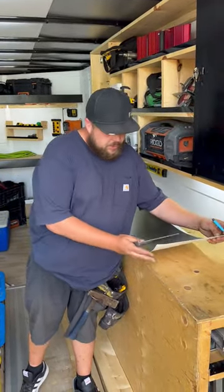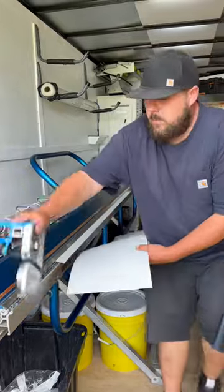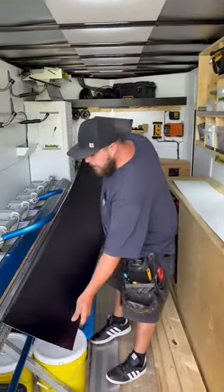Three-inch corner with a 5/8ths J. Get yourself a 12-inch strip. Gonna measure 2-7/8ths up each side there, boys. Slam her in the little brake there.